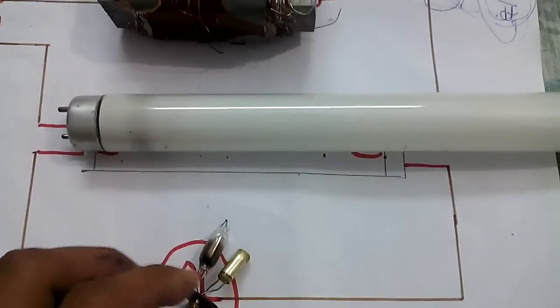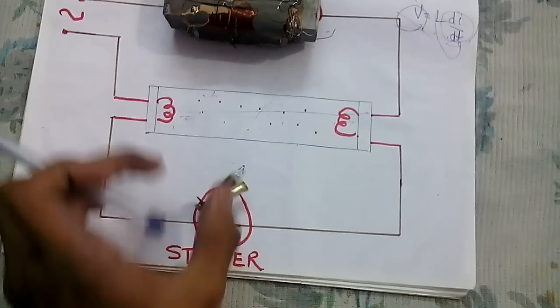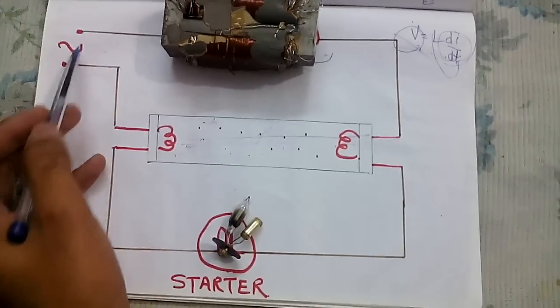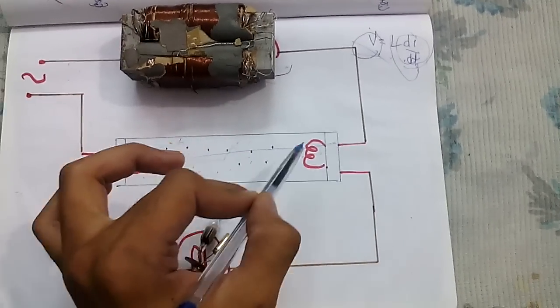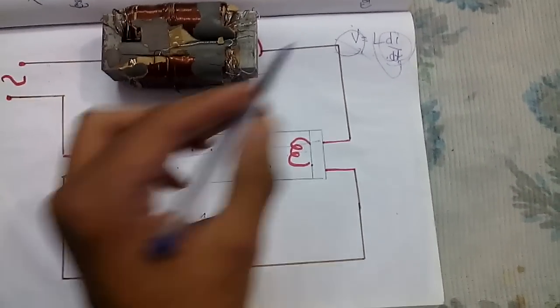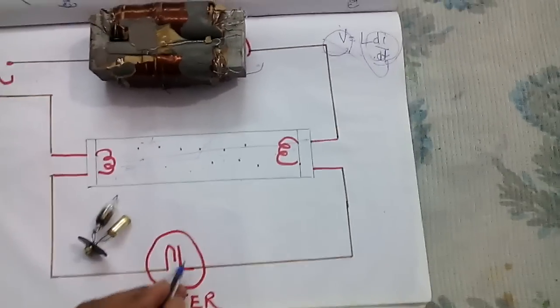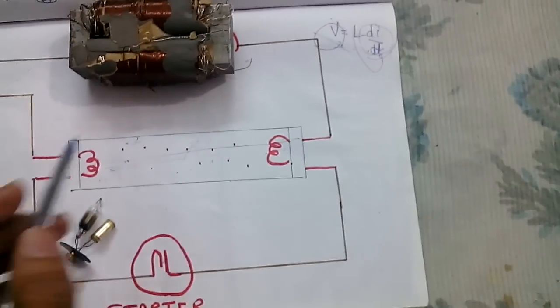When the strips get apart, there will be a change in current in this circuit. Now let me explain the circuit. I want you to imagine these two things as two resistances connected in parallel. The circuit starts here — we give our AC input, the circuit goes from here through the coil. Initially the circuit will be activated, and when activated there will be a voltage across this strip and it will get heated up and get connected.